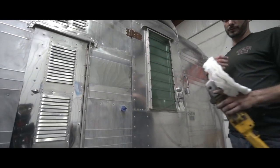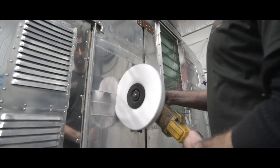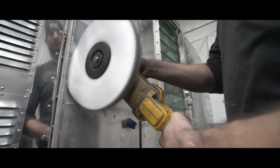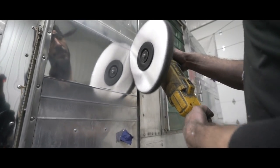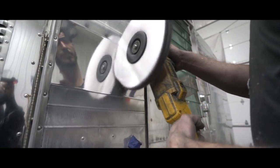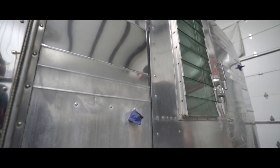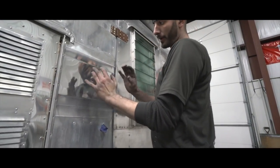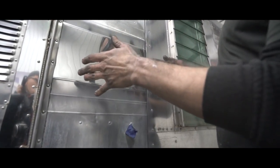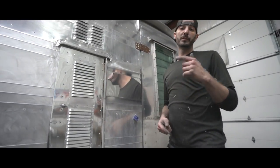For our last pass we'll use the flannel buff at 1,400 RPM with just a little bit of blue moon compound. That leaves a perfect mirror shine — all the darkness is gone and it's got a perfect shine. On the bigger sections it will be a little different since the small sections are broken up by all the rivets. On the bigger sections we'll add one more step — the cycle buff with the Pro 40 finish.